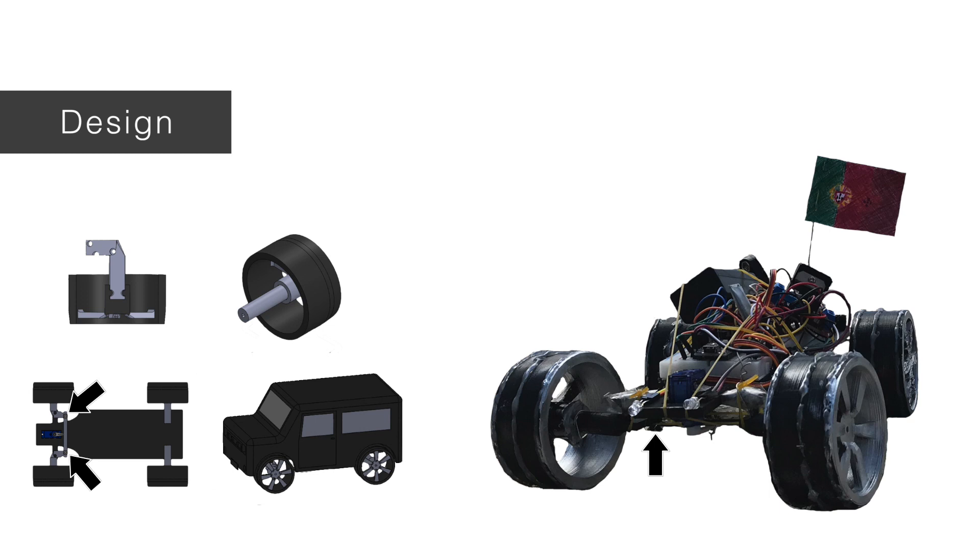The two joints at the intersection of the bar and the axles were built using two screws along with their respective nuts, then embedded in glue to avoid progressive looseness. Additionally, one elastic was added to each axle to compress it against the chassis and assure it would remain with its center of rotation intact — needed due to some shape imprecision of the pieces. The chassis was printed with four supports in case a body is added to the car in the future.